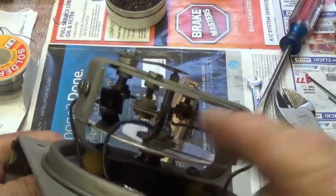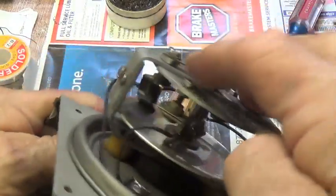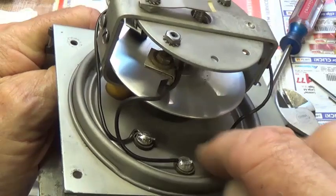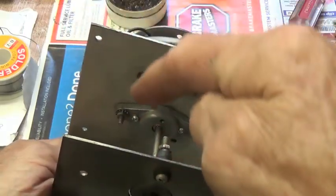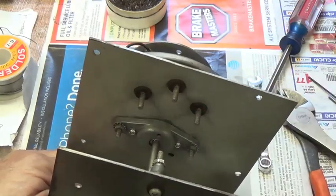The three heads connected to their mounting disc have been installed with the four screws holding them in place, and the wire from each head has been connected to the appropriate insulated terminal and the can lid, which passes through and comes out here, and now the wires from the chassis will come and connect to each of them.